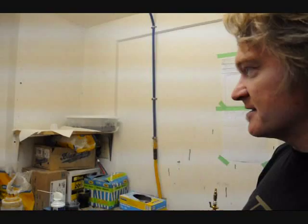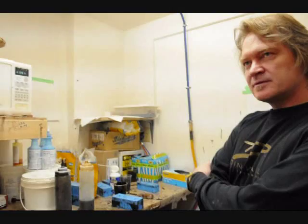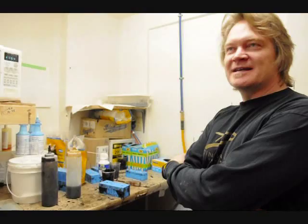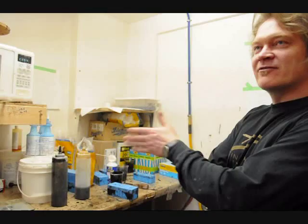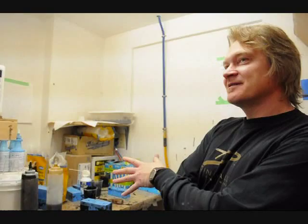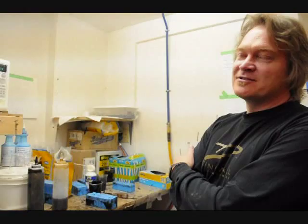And is it a fairly labor-intensive process to make these pickups? It is. It's probably 5 minutes per shell. If you were to injection mold them, it would be less than 5 seconds per shell. But the problem is that injection molds are $5,000-$10,000, and we have 7 different pickup shells. So now we're talking $70,000 worth of just molds. And you don't make one pickup shell at a time, you make thousands at a time. If we're talking 1,000 pickups per run, then you're talking 7,000 pickup shells. We're just way too small to do that.